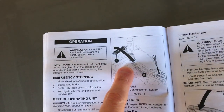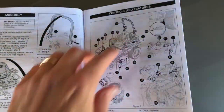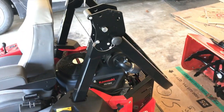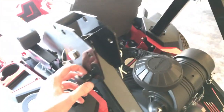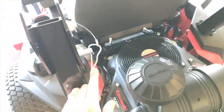Next, for commercial-level mowers like ours, you need to position the ROPS — the rollover protection structure — which is number 15 in the previous video's parts diagram. If you have a residential-level mower, you may not have this roll bar feature, but commercial grade mowers do. For safety, to prevent rollover, pop out the pins, pull the safety clips on each side, pull the knobs out, shift the roll bar up in place, re-secure the pins, and secure the locking clips. We won't do it indoors, as it would hit the top of the garage door.